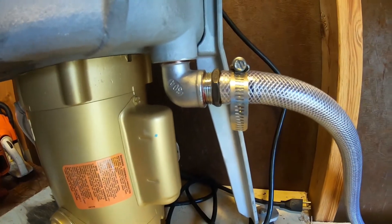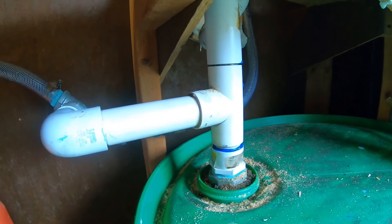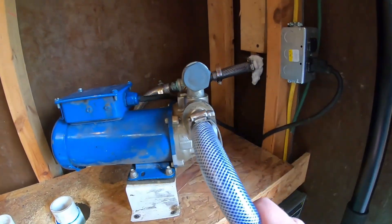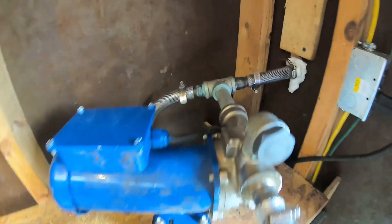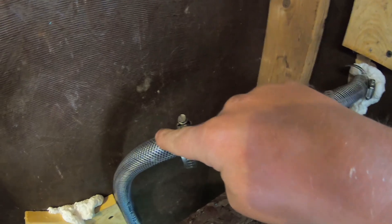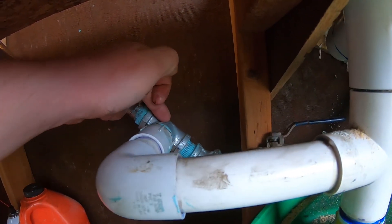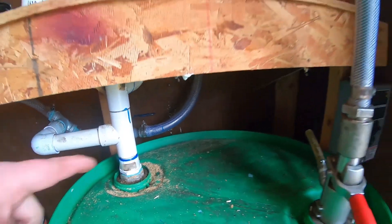And this is just back to the three-quarter inch braided nylon tube. Comes down some one-inch T's and some one-inch fittings down here — just had what I had laying around, wasn't too concerned with it. The pump is all plumbed with three-quarter as well. Mine's set up a little differently: I've got a T coming off the pressure side of the pump. This goes out to our fill nozzle and our filter head outside. This goes down to this valve right here. With this valve shut off, it can only go out to the filter head and the nozzle outside. But with this valve open, it can come back in around here and back into the top of the drum. That lets us circulate this drum, so when we're mixing our thinners — the gasoline, stuff like that — we pour it in the top and that pump will circulate the whole drum for us.